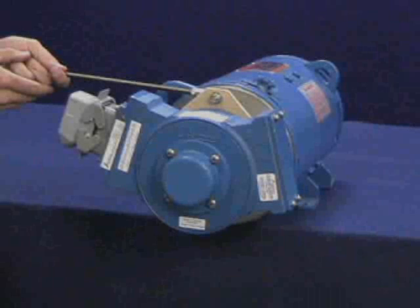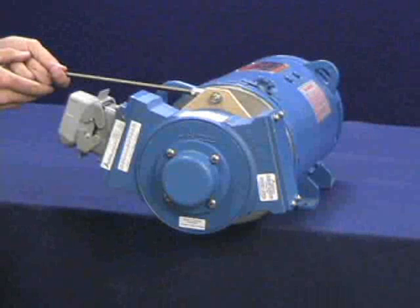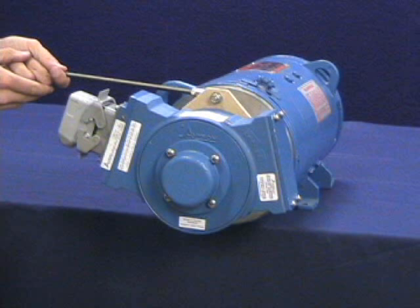AV-685 Removal. The AV-685 employs a keyless shaft mount to lock the AV-685's rotor to a 1.125 inch diameter shaft. An anti-rotation arm prevents housing rotation while allowing for shaft end float. The AV-685 can be installed either as an end-of-shaft model or as a through-shaft model. This video demonstrates end-of-shaft removal.